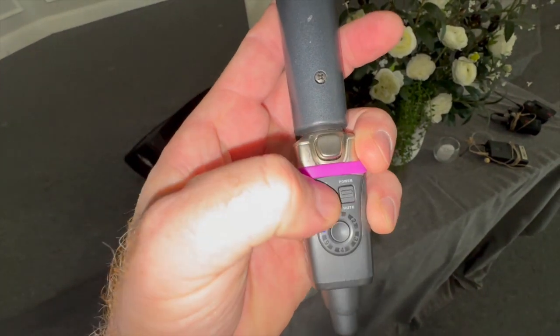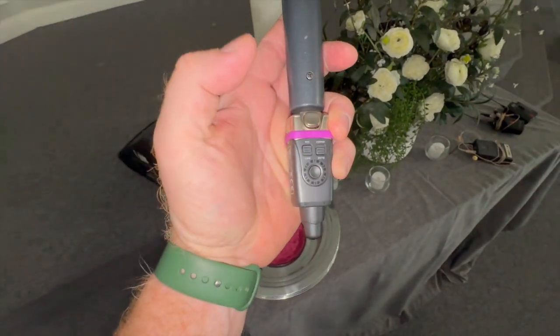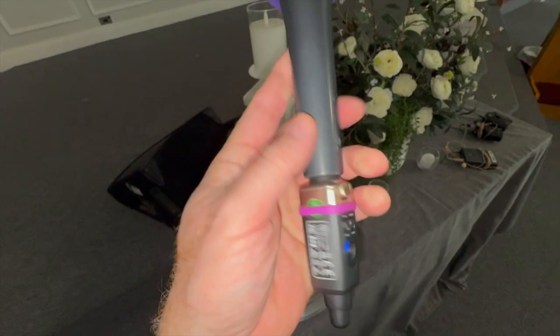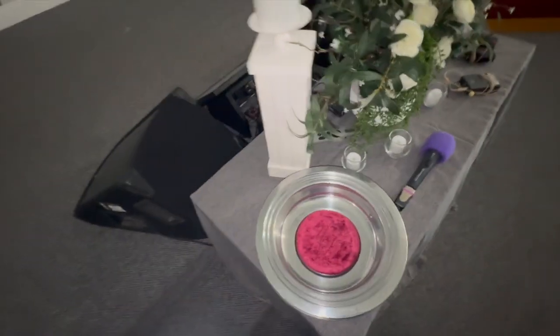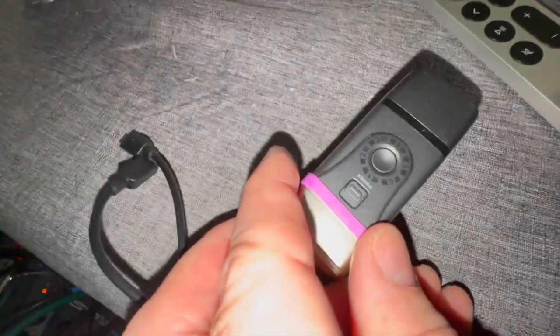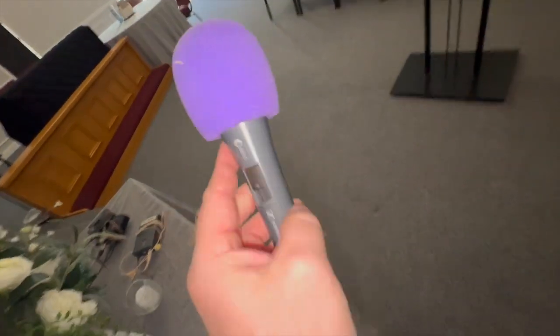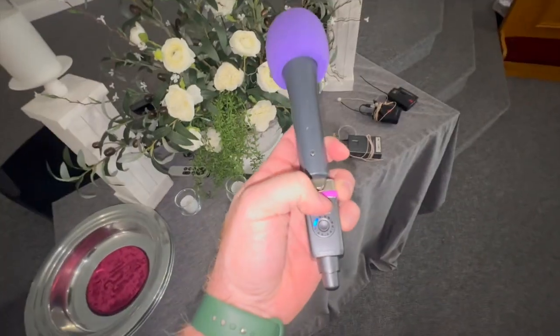There's also a left line and mic switch, and that should be set to mic. You'll have a blue channel light that is on when you turn it on. Red lights come on and then go off when it's working. But even though you've got this on and this on, this mic is still not on unless this contraption is on. So you have to come to the back here — there's a little power button. If that blue light is on, then you've got power. So there are literally three switches for this one mic. If you have the purple mic, you have to make sure all three of those switches are on.